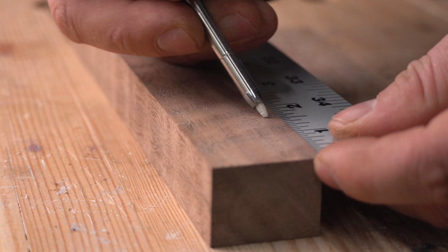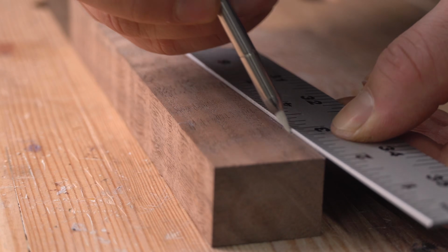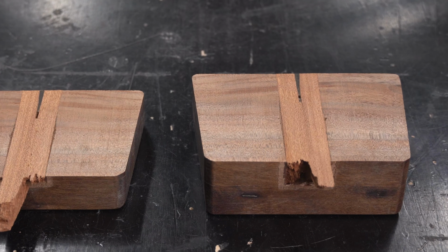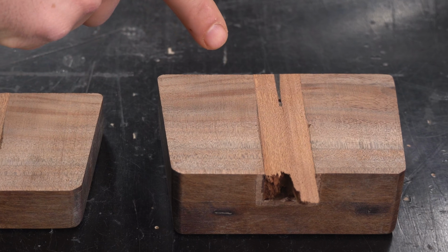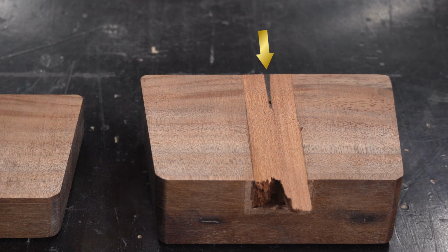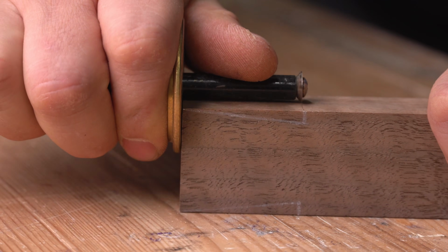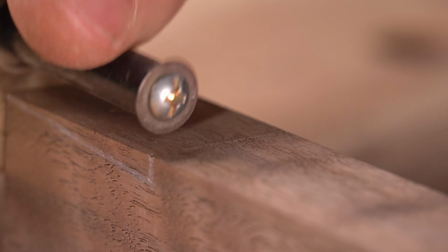So a traditional woodworking mallet is built a little bit differently than how I'm going to build this one. Normally on the inside of the mallet, you'll see the tenon go all the way through to the top with a wedge hammered in to widen that top section and lock it in. And that wedged tenon that I just showed you is very similar to a joint you probably already know, the dovetail.